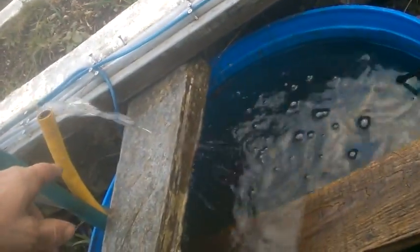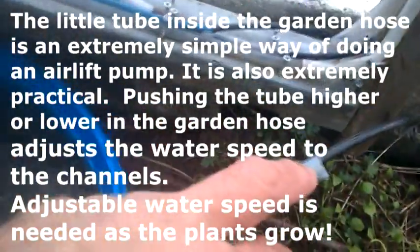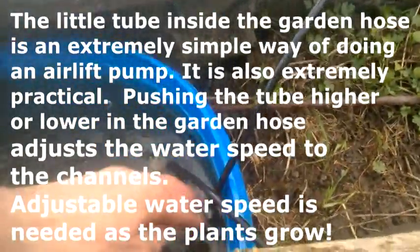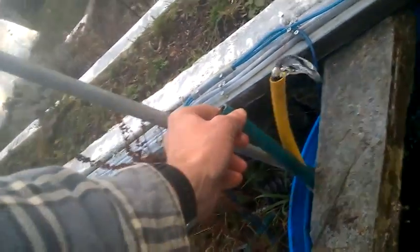So the pipe goes down there, the air goes into the pipe and it goes down to a distance which corresponds to the best place to put the airlift. I did that by putting a pipe all the way to the end — this pipe produces almost exactly the same speed. I put a little tube all the way to the end, as you can see here, and then I just pulled it back. I had a little piece of duct tape on it right there, and then all you do to find out how far you've gone is just measure it. That corresponds to how far down in the pipe it is.